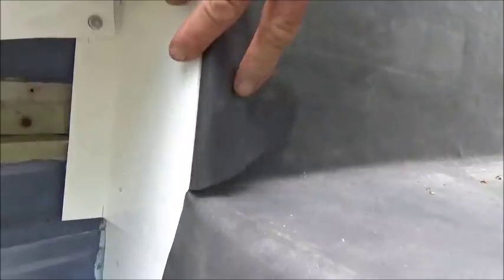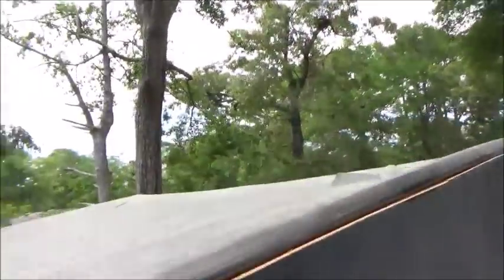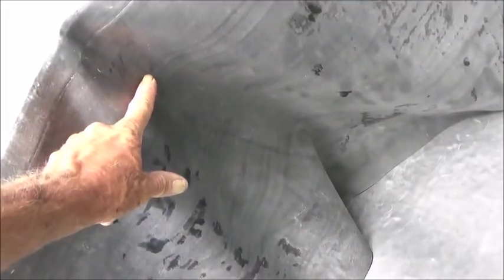We've got metal in all around here — just make a piece of metal, that's all you've got to do. Then this rubber gets over here and is glued down, terminated with termination screws and all that. This side will also be pulled down, and that big piece hanging down there will be cut down to the termination bar screws and the edge trimmed off carefully.